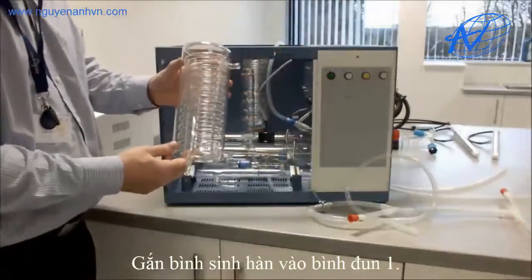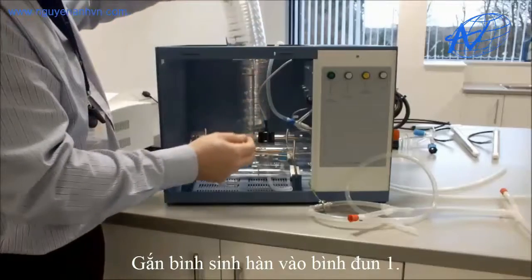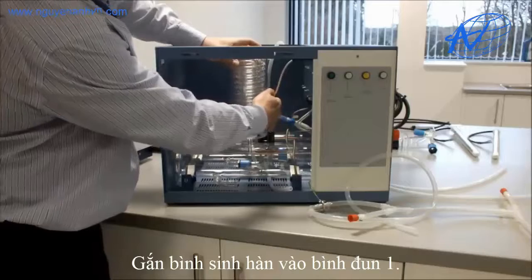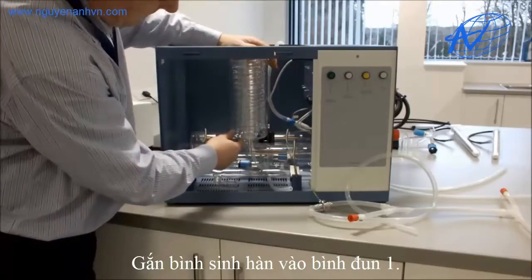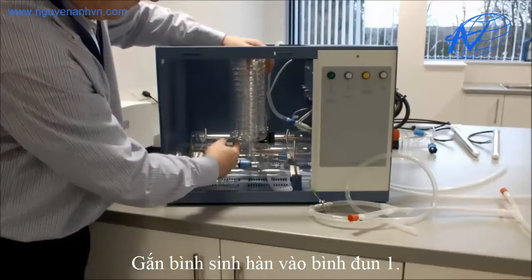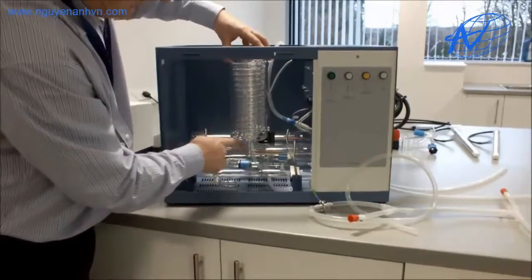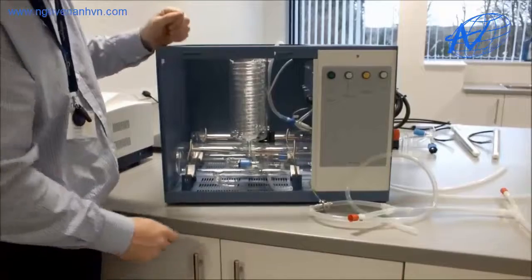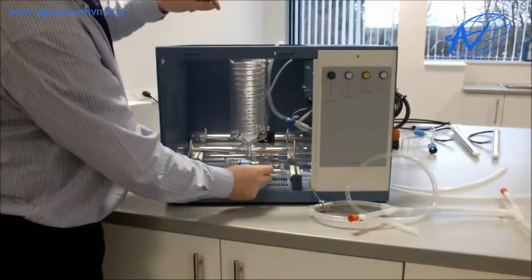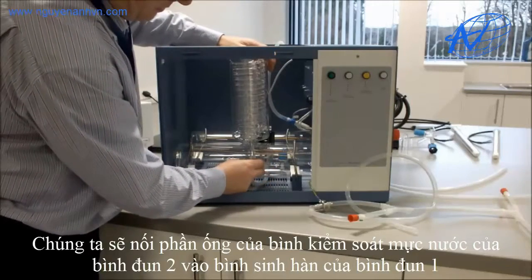We then connect our condenser to our front boiler. Same as the rear one, it's fitted on — when you feel some resistance, push down slightly to create a seal to about three quarters of an inch above the boiler. Again, the outlet is facing the front. We then connect our 300mm 8mm hose from our rear boiler level control to the outlet of our condenser.